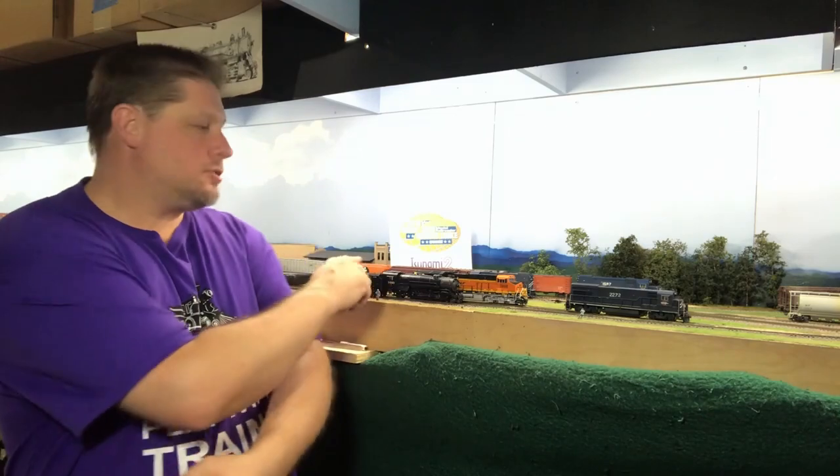Now, when we're on the main line, any CV programming command is no different than sending a function command. It's prefaced with an address. So if I was to send a programming command to locomotive 2272, say we want to change the horn volume, then all I would do is send my CV via the main line. The programming command is prefaced with address 2272, listen up, here's the command. All these other decoders, 3888, 1460, and so forth, ignore the rest of that command.